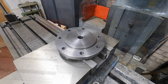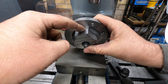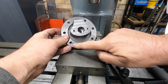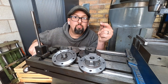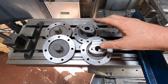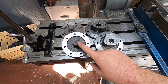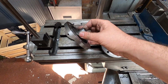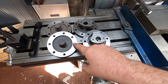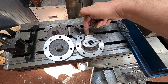So that's it for this, now that's done. We can take it out. The only thing we've got left to do is put a hole in here for the slide bar, but we're going to do that once it's bolted onto the cylinder. I'm just going to give these a quick deburr and then onto the other cylinder covers - just like that and they're finished, well nearly. So that's both sets, front and rear, all got the holes in. All that's left to do is machine this stub off here when they're ready to be trial fitted on the cylinders. Once we put all the holes in the cylinder, these ones just need the hole for the slide bar. We'll fit them to the cylinders first and then we can get a datum on the center.